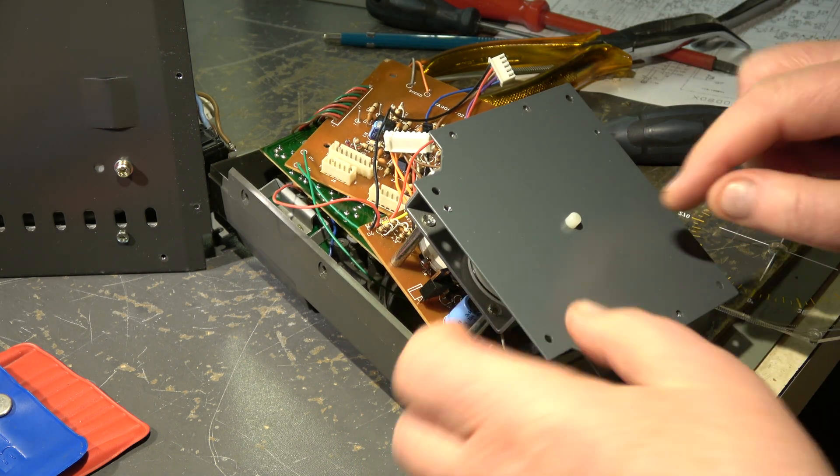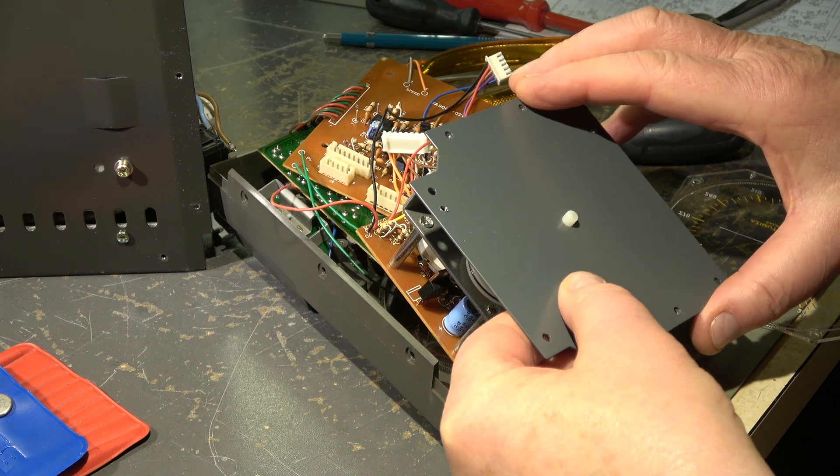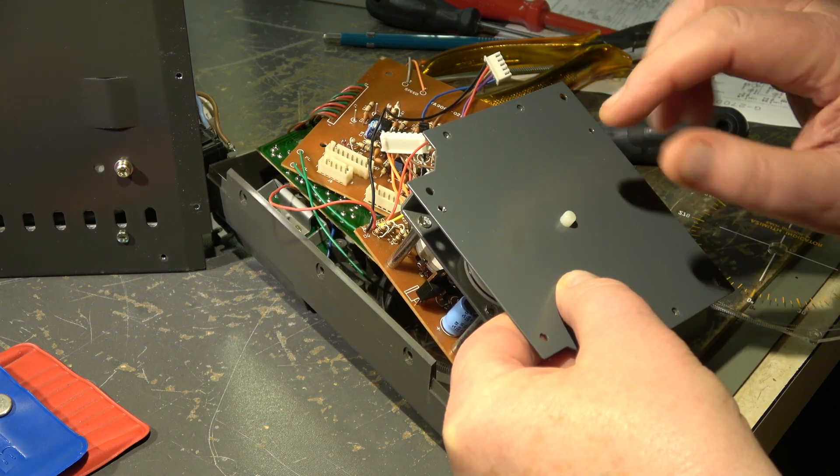The wheels are in place again and the allen screw is set. Do not over-tighten it — it's a dangerous construction. The thread of the allen screw is in the plastic, and if we over-tighten it, it cracks. This is old plastic. The unit can now be installed with the four screws, and this is the fixture for the pointer.